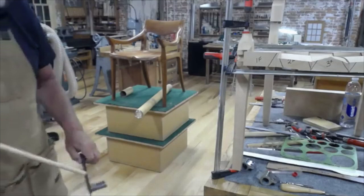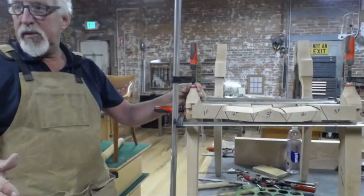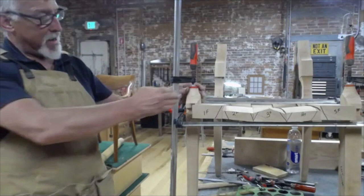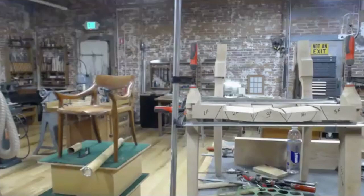And the reason for that, it's really important. You don't want to do this with a straight dowel. If you put a dowel in, come to assembly time, and you knock that in, you get a hydraulic lock. Mm. You snap this leg. Boom. Ooh, yeah. You've got 2 weeks worth of work into this chair, and all of a sudden, boom! You lost a leg. No recovery. So I've drilled this, I've made my dowel, I fit it, I'm confident.